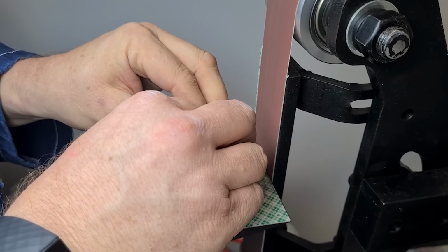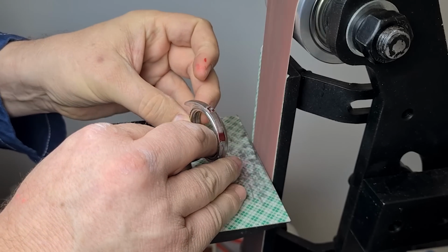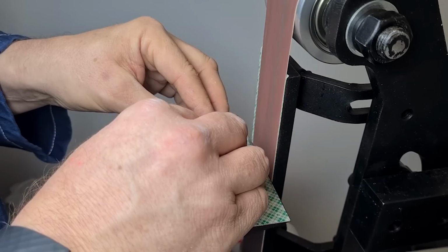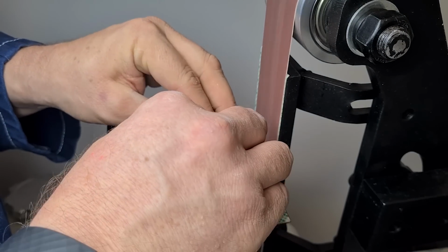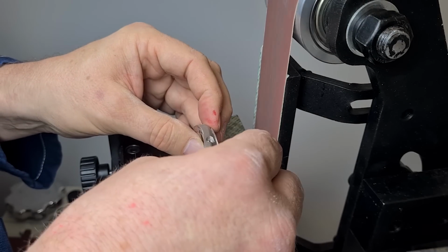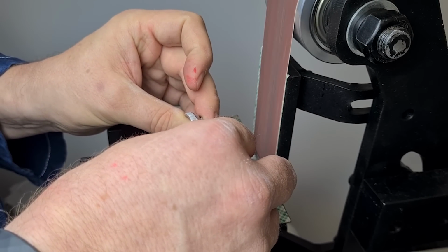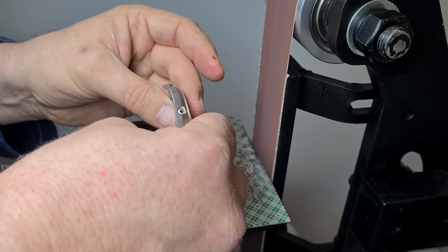The issue with refinishing cases, with polishing them and so forth, is that you do remove metal. It is possible to add metal nowadays as well with laser machines. But in general, you remove metal every time you restore a case. So that's also why we want to be as gentle as possible. This case is old, so we're not gonna go too aggressively on it. There will be some marks on it still, but at least we're gonna make it look a little bit better.